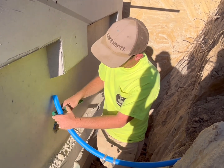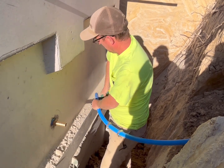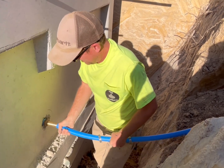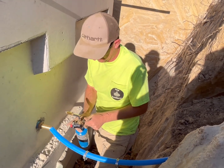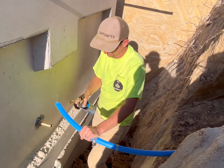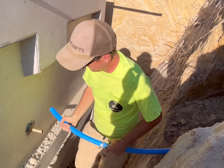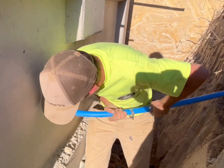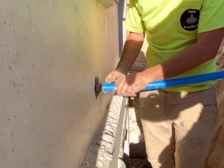160 PSI or 200 PSI is great for underground water lines. We're going to cut this shorter, then use a propane torch to soften the end of the pipe, and then push the pipe onto this barb adapter and wiggle it in. We like these long barb fittings — plenty of barb to grab onto.